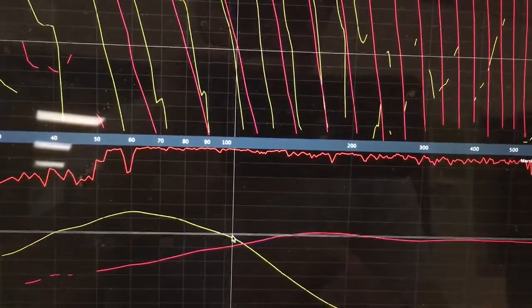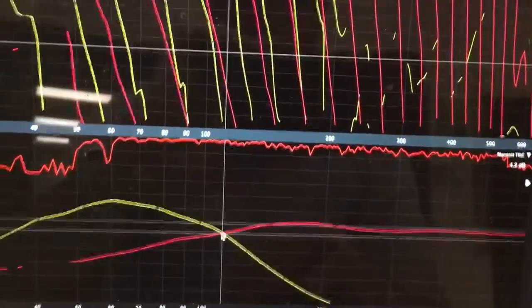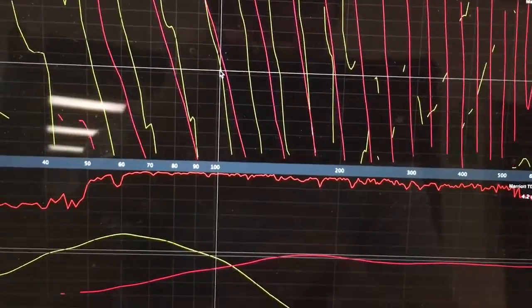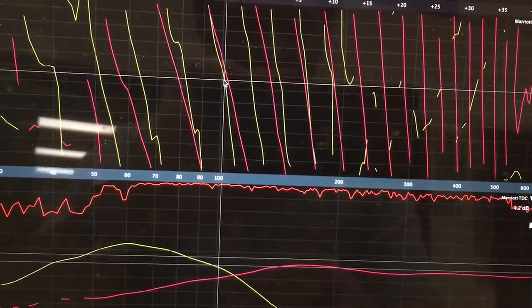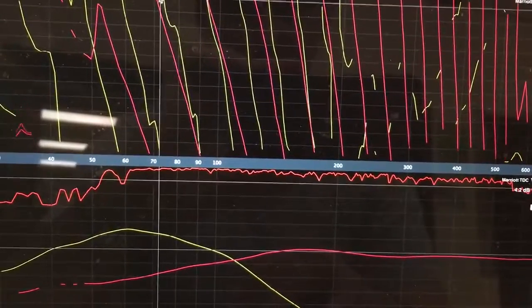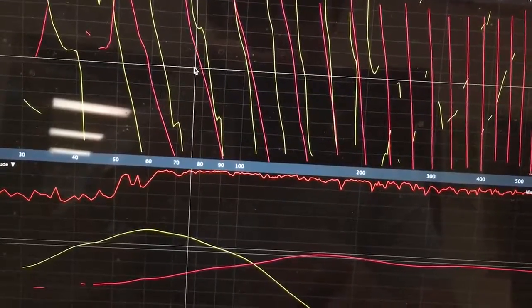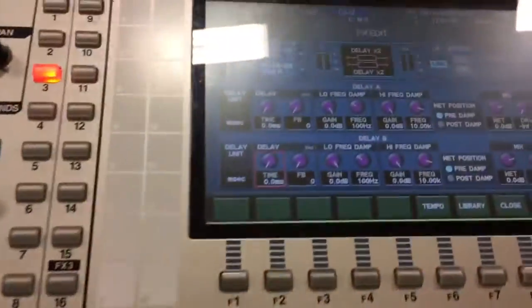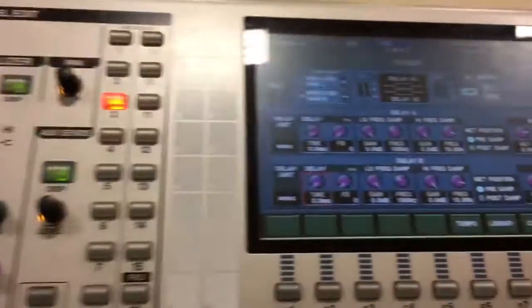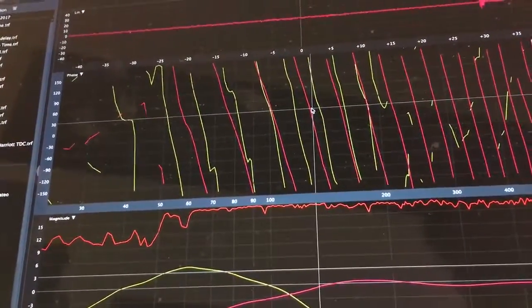These red lines are now my high-frequency tops. What I'm looking for is where the two traces cross over — right there at 111 Hz. The nearest trace to that is going to be around there. I am sort of over-driving the subwoofers at the request of the venue. What we want is to get these red traces to stack up on top of the yellow subwoofer traces. As you can see, they're pretty far apart right now, so watch what happens when I start adding delay to the highs — you'll probably hear them going in and out of phase.